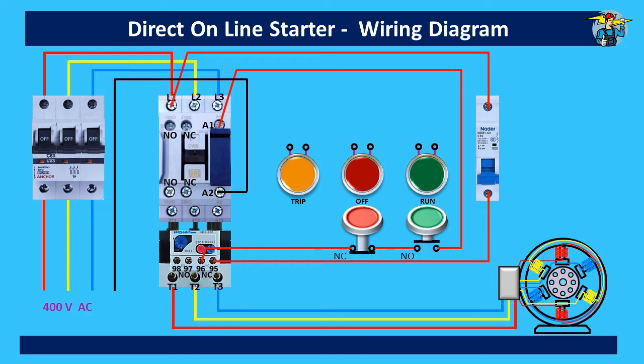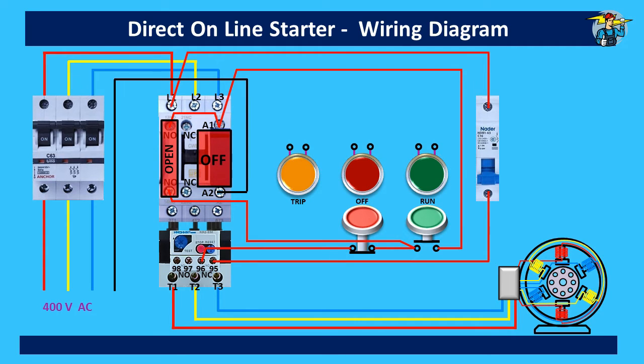To avoid this situation, we use a bypass power line through the normally open auxiliary contacts of the magnetic contactor, which will be closed when power is introduced. Since control power is available up to the left side terminal of the start push button, line is taken from there through the normally open contacts to the A1 end of the coil. Now the motor will start running by pushing the start button and will continue to run even after releasing it. If you want to stop the motor, push the stop button and the motor will stop. Even if you release the normally closed stop push button, the contactor will not get energized since auxiliary contacts have gone back to their normally open position.